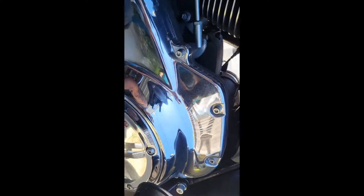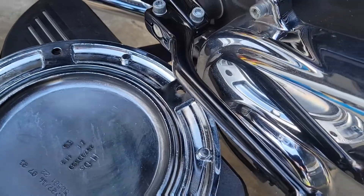I just ran that screw in by hand — I'll torque it up in a minute. Now I'm going to start taking out the cover screws. You want to throw a rag on the cover while you're taking it off so it doesn't fall and scratch. Leave the last one in a little bit, take all the others out, then slowly remove that last one with the rag on it.